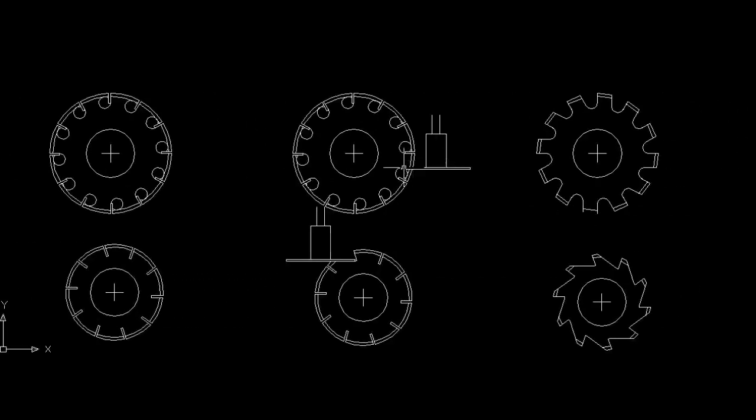With the Eureka tool, you're just cutting on the bottom here to form these teeth that you can see over here. Here I use the back side of the tooth to cut a relief behind the cutting edge. These are the cutting edges here, and I'm just cutting a relief in the back, and you can see it comes out like that when you're all done.